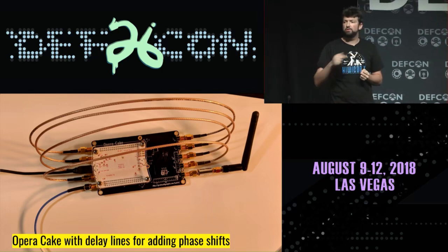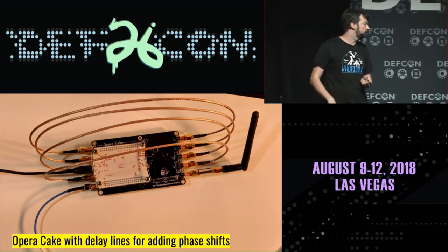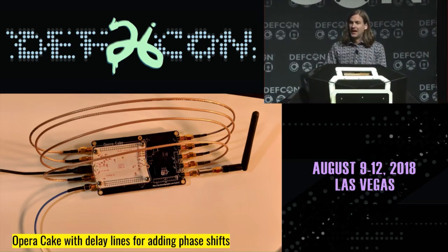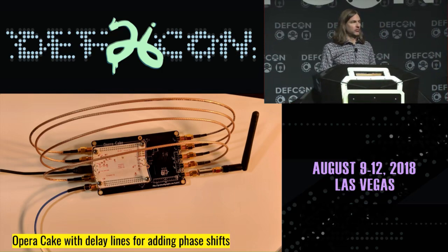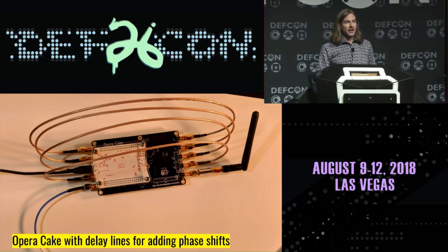Now, because we're using a Bluetooth dongle to feed this, our frequency is 2.4 gigahertz. And we have a little 2.4 gigahertz bandpass filter in between the Opera Cake and the antenna. That's actually one of the nice things about using the 2.4 gigahertz band for this kind of demo: you can get readily available, low cost, and highly effective filters.